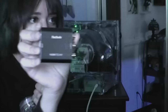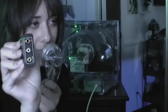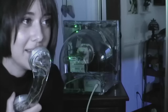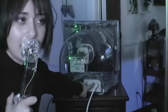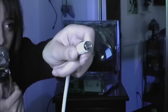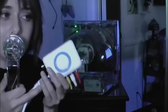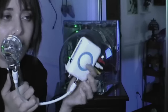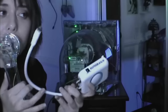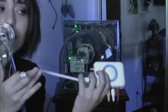How I get pictures on my TVs is through these little guys — these are HDMI to AV converters. On one side you have an HDMI input, and on the other side you have an AV out. If a TV does not have an AV input, all TVs have an antenna cable input. The end of those antenna cables will look like this. You can still use one of these HDMI to AV converters and go into one of these — this is an AV to RF modulator. Both of which you can find on Amazon.